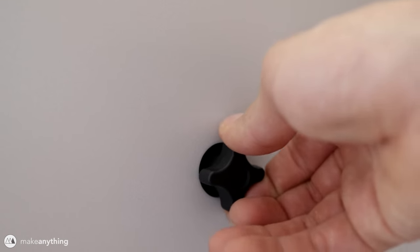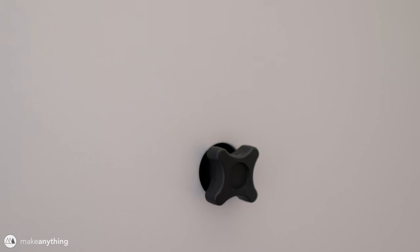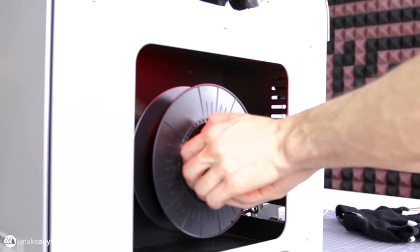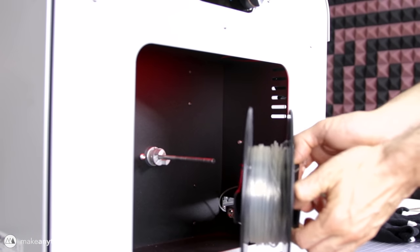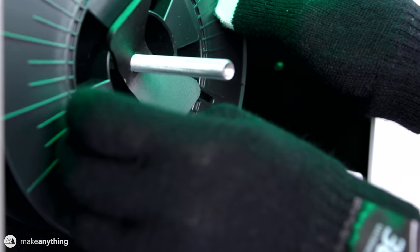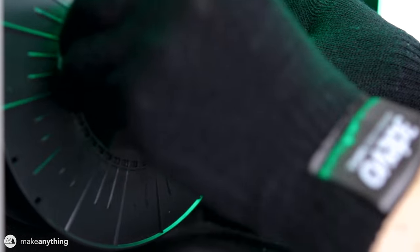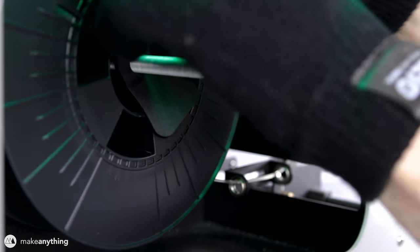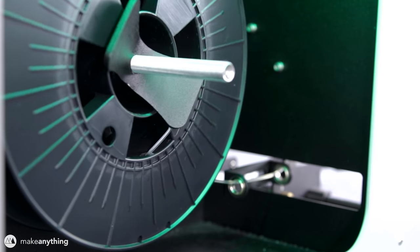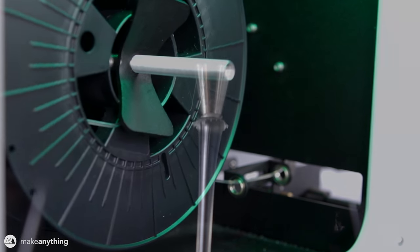There's a knob on the back that adjusts the tension on the filament winder. I had it a little too loose, which caused the filament not to wind as quickly as it was being extruded and created a mess. So I had to cut that spool short, but that gave me the opportunity to try winding one more time. This time I fed the filament through the correct hole and bent it into place - a bit cleaner. I also taped the initial piece of filament into place to help maintain tension. With the knob tightened, there was no more slipping and everything worked like a charm.